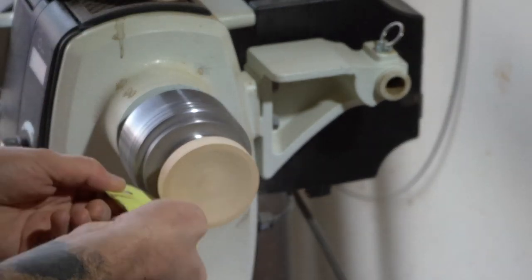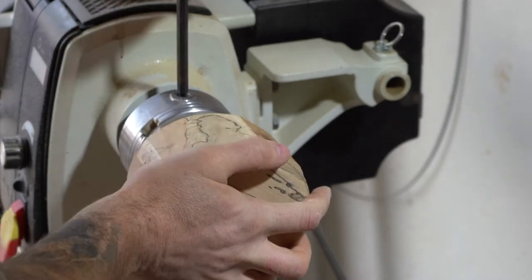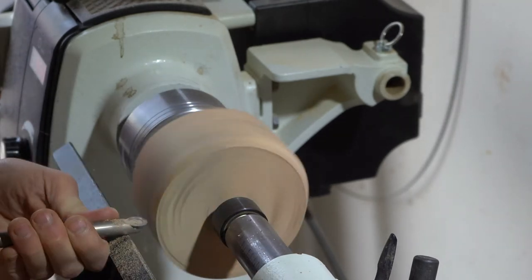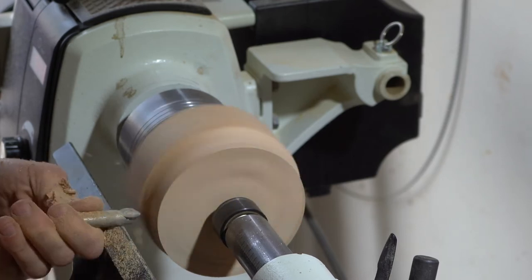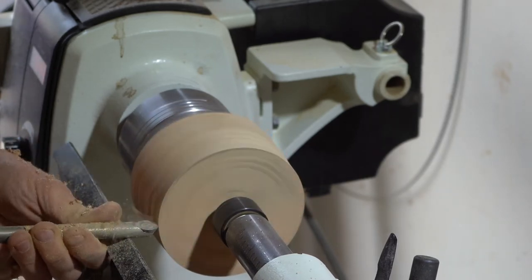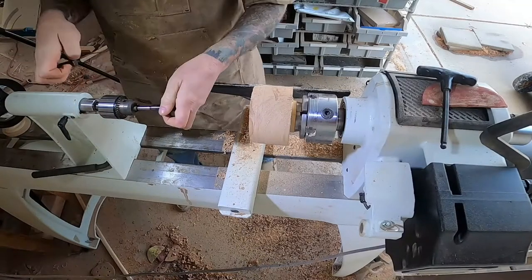And when doing the inside part of it, once I take this piece off the lathe I'm not going to be able to get to that part and do it again. So I chose to sand it and get that ready first. And then we kind of just need to make our body round - get the rest of those sides knocked down and get it nice and smooth. And sometimes you'll see me use the tool to see if it's smooth - if it bounces off, it's not.